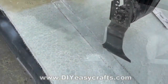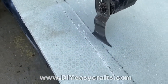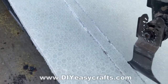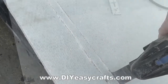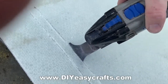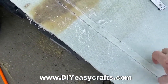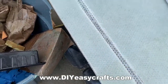In order to cut that groove, the multi-tool really worked out nicely. You just mark out your lines and don't let the blade go all the way through — you're really just cutting that top layer of glass. Then once you make that cut, make some plunge cuts in at 45 degrees or so and chop out that top laminate. Then you can dig out whatever's remaining on the inside, either with the angle grinder or with the multi-tool.